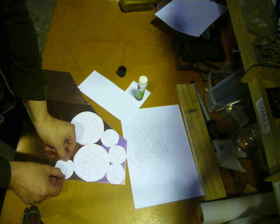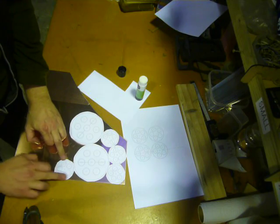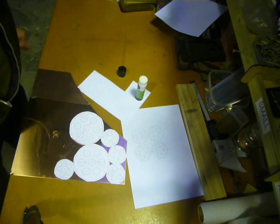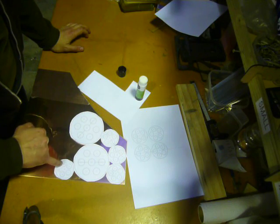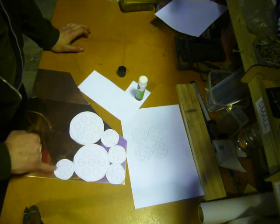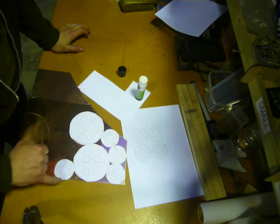I don't want the paper sticking to the copper or staying there for the whole process. So the water-based glue stick just makes it easy to come off again. All I want to do is punch these centers and make sure I've got those as accurate as I possibly can, then scribe, if I need to scribe the outside of the baffles for cutting, I'll do that.